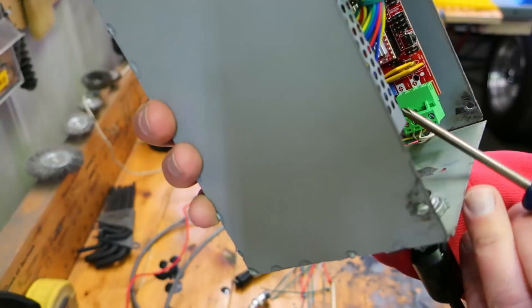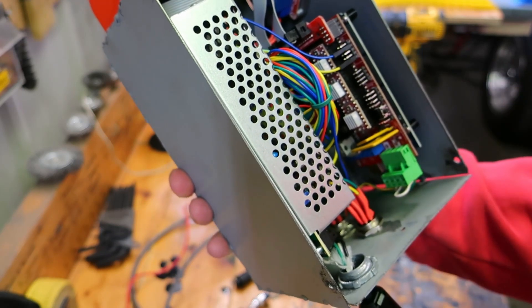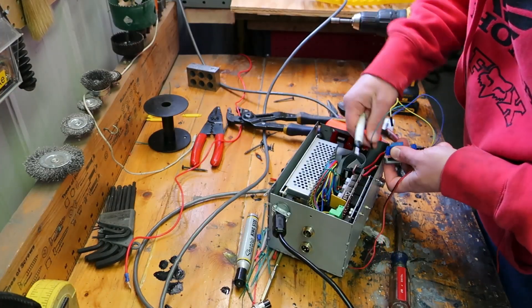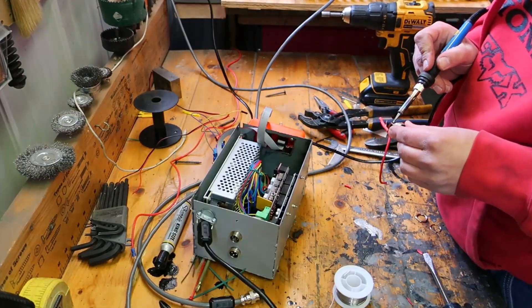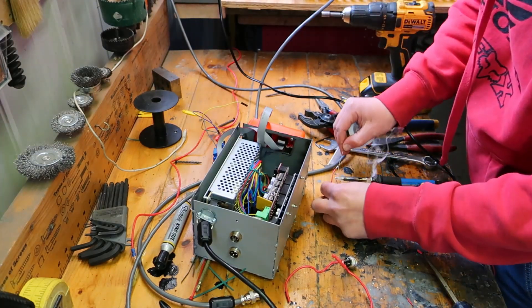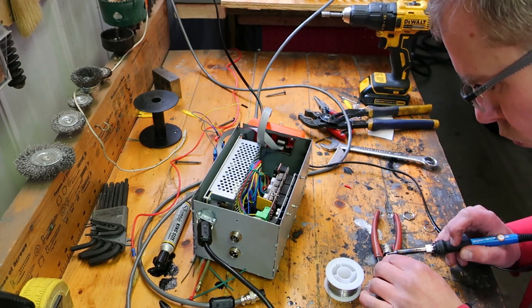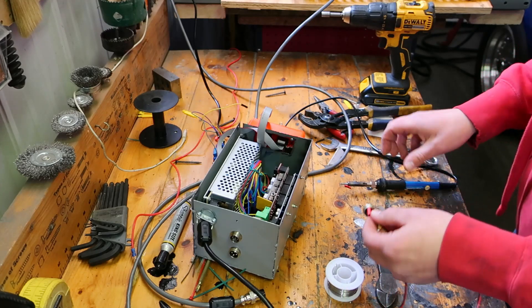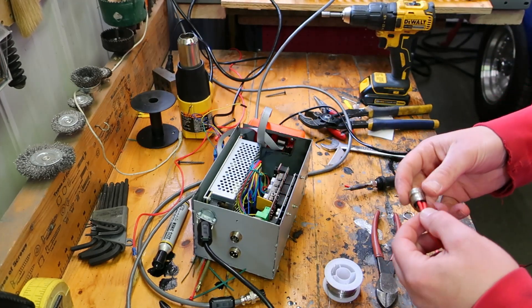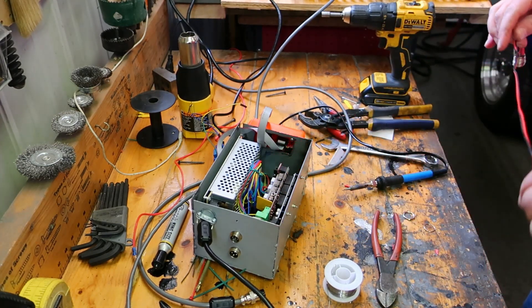So I think I might take that one out. We're going to have D9 over here power the new relay instead of using pin 44. I think we're going to eliminate all that stuff just to get rid of unneeded parts. We're going to have a little heat shrink. I tried to only buy marine heat shrink that has the glue in it, but for most of this stuff it doesn't really matter that much.